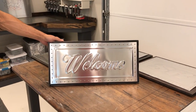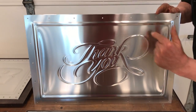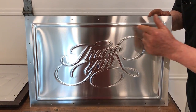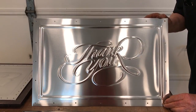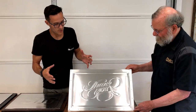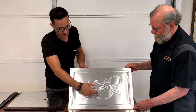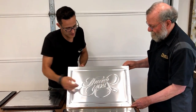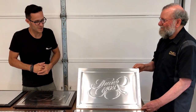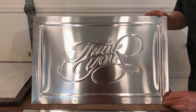What I love about Jamie's work is the elegant line work he creates — not just the flowing curves, but the way he contours the metal to accentuate the curvature of the line work. That's his signature, and it's absolutely magnificent. One of the things I try to do is make everything look worked all the way across — not just a flat piece of metal. We do this with a skateboard wheel, going around the edges to give it that contour, so it has what Ron would call English, or volume — just moving the metal around a little bit.